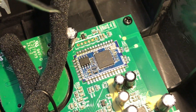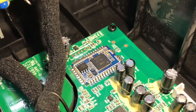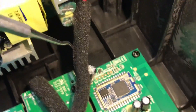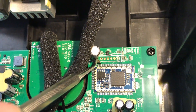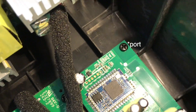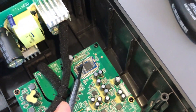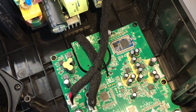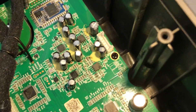The Bluetooth chip is a CSRA64110. Its SPI programming pin is right here, again very nicely labeled. So you can also play with this — remove the annoying sounds and whatnot. The rest is pretty much just support components.